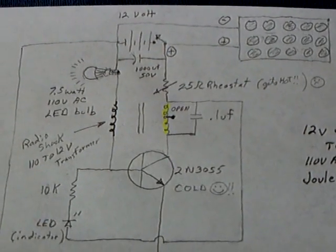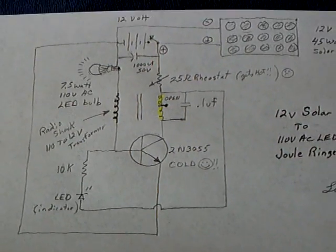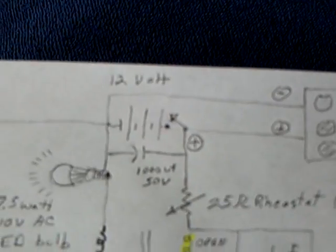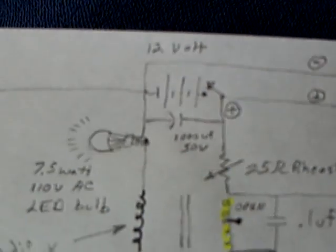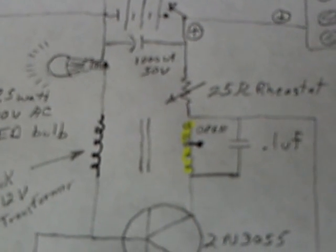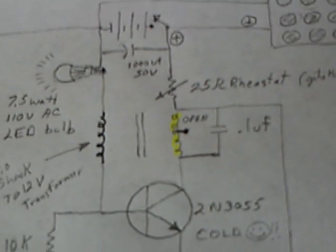This is the circuit I've now worked with here. It is using a 45 watt solar panel, 12 volt. I can go straight into the circuit or I can charge a battery and run this RadioShack transformer. And you'll notice this is not a blocking oscillator circuit — this transformer was used by a number of people earlier on as a blocking oscillator, but it's not wired that way right now.